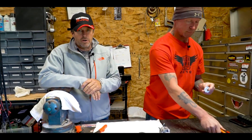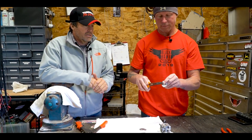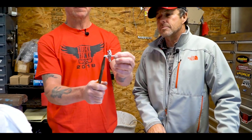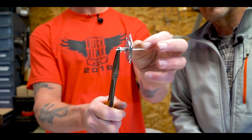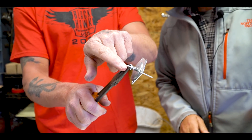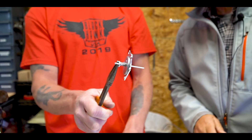You can get the rivet washers along with the rivets at any Ace Hardware, Home Depot, Lowe's, etc. It's a washer made specifically for a rivet. The rivet is aluminum and the washer is aluminum as well. You want to hold the rivet with a pair of pliers, because if you don't, when you go to pull the rivet through, it'll end up deforming the whole thing and it's not going to work properly. We're only interested in pulling it through enough to where it mushrooms out the rivet so that it keeps the spring and the washer in place.